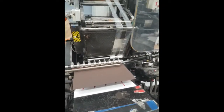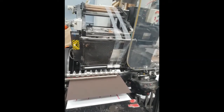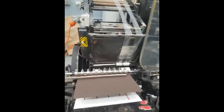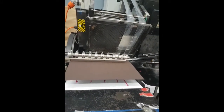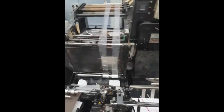Also, just to mention that we're using Milford Astor, or Foilmakers I think they call themselves now, triple F 000 foil for this. It tends to work nice and sharp compared to some of the others, especially on uncoated paper. It seems to work good. I've had to adjust my foil draw length. I don't know if you can see here, but some of the images were doubling up on each other, so we just adjusted that slightly. Hopefully it'll work.